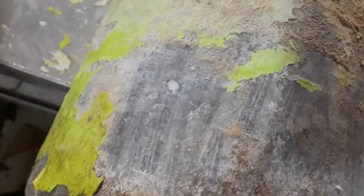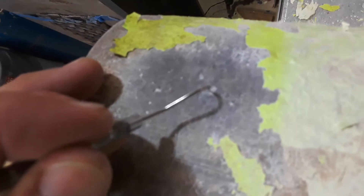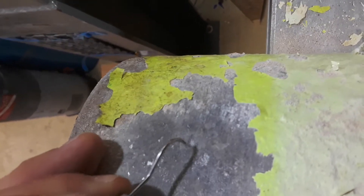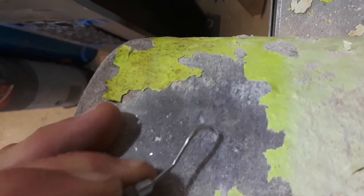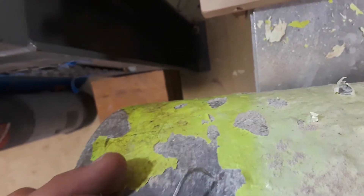That white oxidation is actually eating into the metal — if it remains there it will eat right into the metal. I can already see a nice pit, and that pit is full of oxidation. The next step is to probe and see how deep the pit is. We'll take a brush and try to get some of that oxidation out, then take a handy little pick to probe the depth. It looked deeper than what it is, but it's pretty deep. It's got a second pit here and a third little pit here — it's all kind of concentrated there, with some more pitting visible as well.